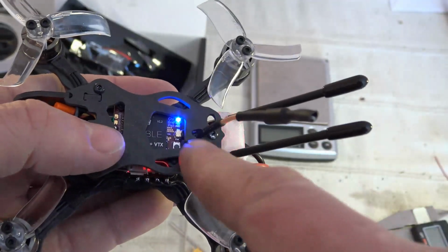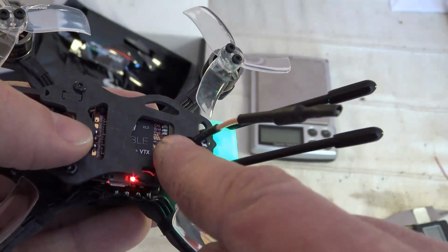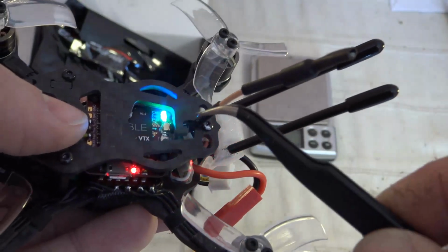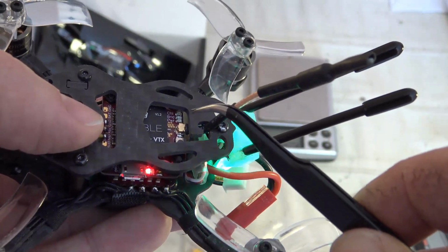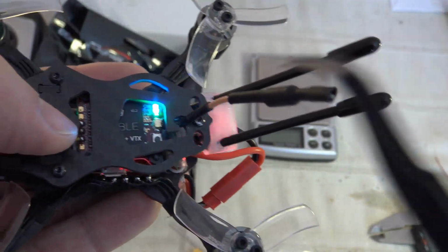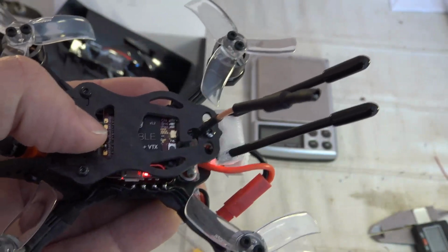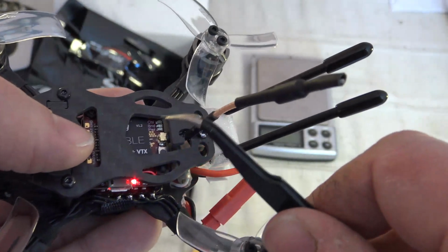For the video transmitter, you can see the lights here. So currently you can see the flashing procedure. So after a boot, okay, you can read here. You can see 3 green lights and 4 blue ones. For the red, it's on 0, so only 1, sorry. So it means it's in 25 milliwatts. So every 10 seconds you have the beginning of the cycle of the lights.